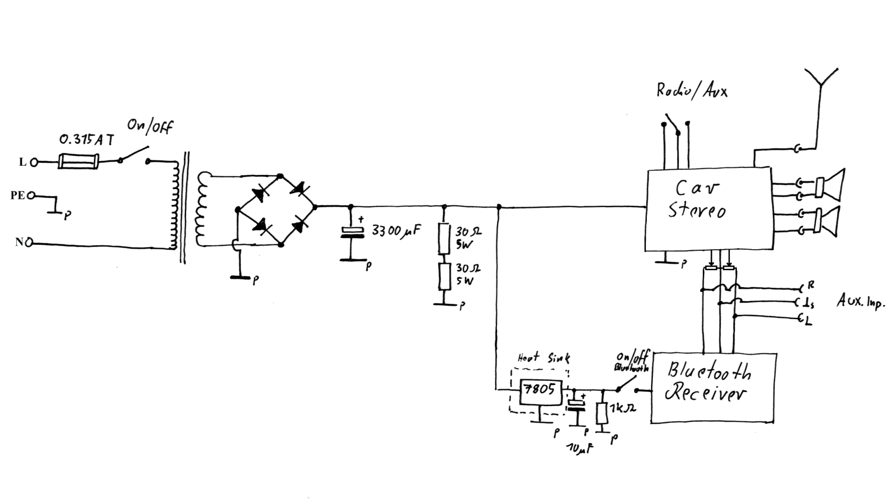Some of you might wonder if an ATX power supply could be used for this job, since you also get a 12V and a 5V rail from it. That is right. However, I have tried to use older ATX power supplies for audio amplifiers, and I have literally heard that they are too noisy for the job.